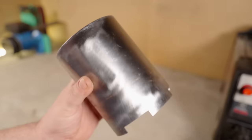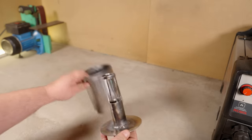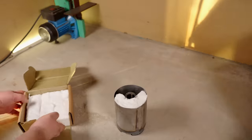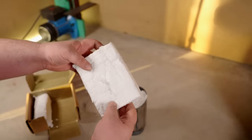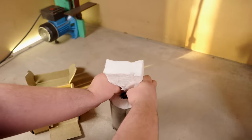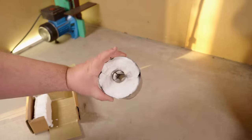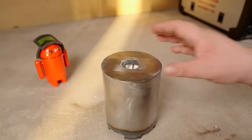Cut everything out and, after a dry fit, welded the bottom and the small central tube. The filler for the working model will be ceramic wool, snagged some on a deal, and it came in handy. Filling the stove's interior with it. It's got to absorb and retain high heat well. Next, I'll weld the lid on and add a stand for the cookware made of thick wire on top.